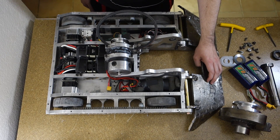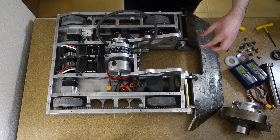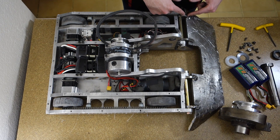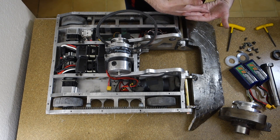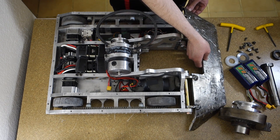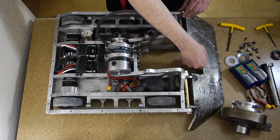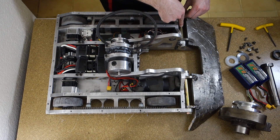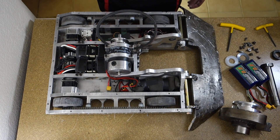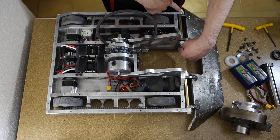The wedge is all titanium — 0.33 inches, just a little less than 3/8ths. It's got four little pieces welded to it that act as a hinge; they're water-jet cut and interlock before being welded so not all the stress goes to the welds. It's about 7 pounds. The hinge pins are 7/16ths — whenever I get hit by a drum and the wedge flips up, I bend the pins. So now I use super-long grade 8 bolts with the threads cut off and a shaft collar on the end to keep them from falling out.